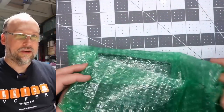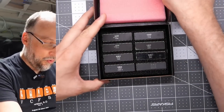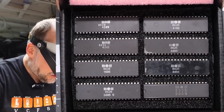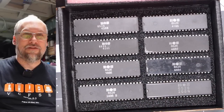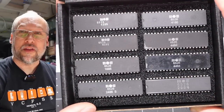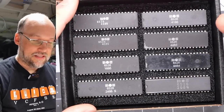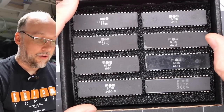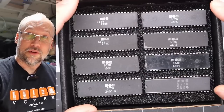Let's see what we have here. We have a little package which looks like it has some ICs in here. Let's get the magnifying goggles on and zoom in on these — 6526s! Look at this, wow, eight of them. That's spectacular. If you watched that last video where I fixed five machines, besides bad RAM, a bunch of them also had bad 6526s. This is the I/O chip on the 64 that's responsible for the keyboard and joystick, along with the disk drive and user port on the other one. There are two of these in each machine, and unfortunately these chips do go bad.